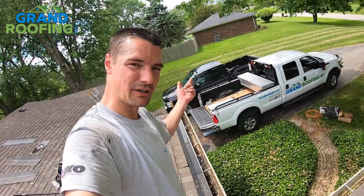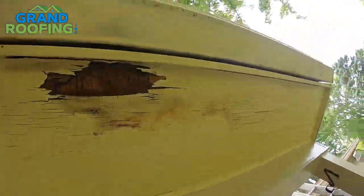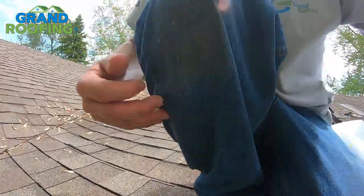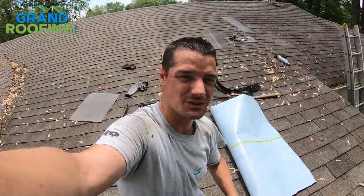They did not overhang it over the edge metal — it's wicking back up and rotting it out. Let me show you the damage down here: it's kind of rotten out in the soffit there, because it's smooth and flush and water's running under.